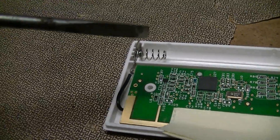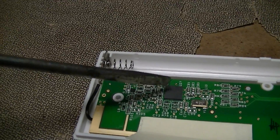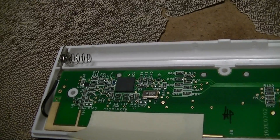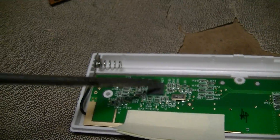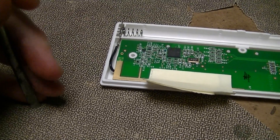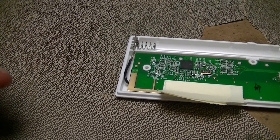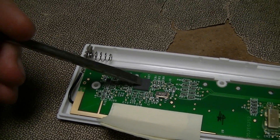This looks to be just a two-layer board, so it's probably not something like a pseudo-LGA or even LGA — there are some chips that look like QFNs but aren't. There's a crystal for it, about 39.8 MHz, maybe 39 megacycles. No loading caps on it, which is somewhat interesting. This looks to operate in probably the high 100 megacycle bandwidth — probably around 800–900 megacycles. I think there's a band for stuff like this at 915 megacycles, but that's just off the top of my head. And that's of course going to be PLL'd up in the chip.